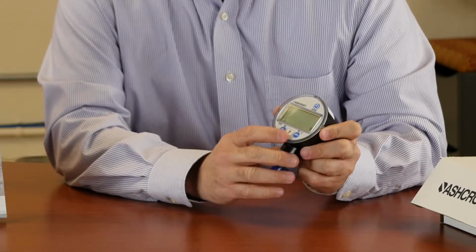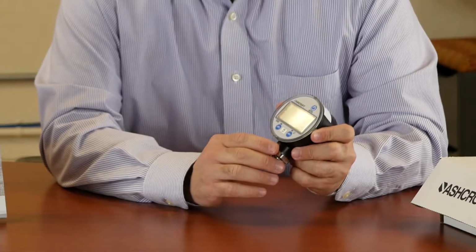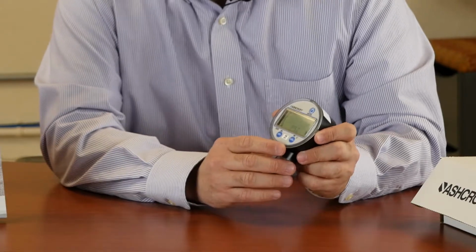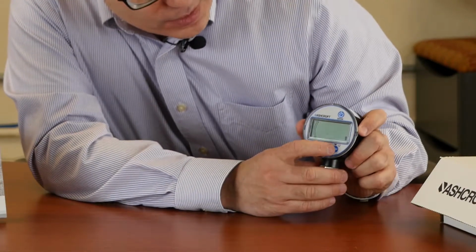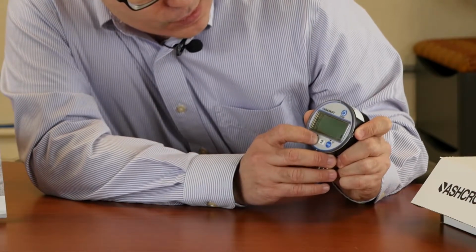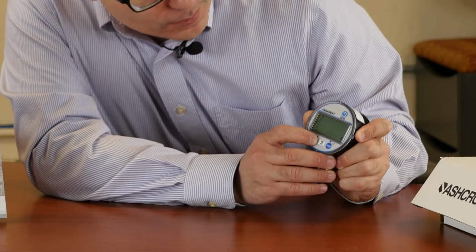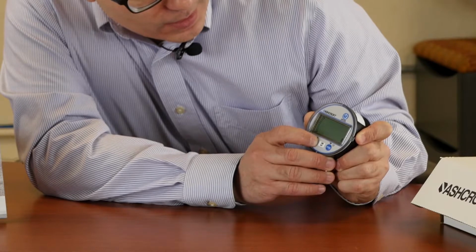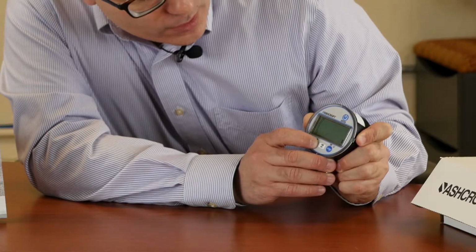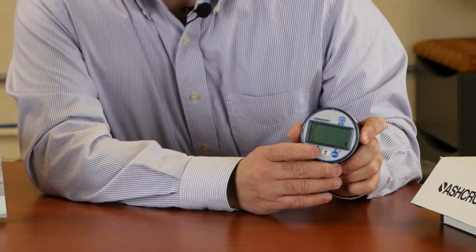And I'm in the units of measure. I just wanted to really highlight that. There's 10 different units that you can have. 9 are programmed already, and 1 that you could custom program. So right now we're looking at PSI. There is bar, inches of mercury, centimeters of mercury, millimeters of mercury, kPa, MPa, kilograms per centimeter squared, feet of water, and then the custom unit is right there.